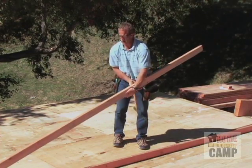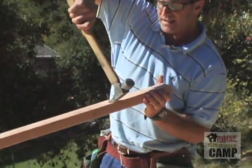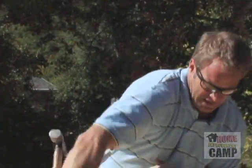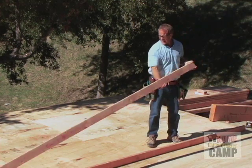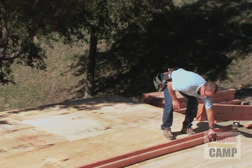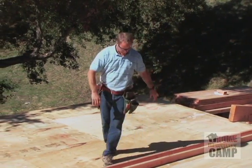It's a good thing to use duplex nails too, because some framers will use eight-penny sinkers, which are the green nails, and they'll just turn the board up. So those little nails will be sticking up on the inside of the wall, and that can be a little bit difficult on your foot when you're walking through the house. So again, our plates are like this - we'll pull them apart and we'll still be able to read them.